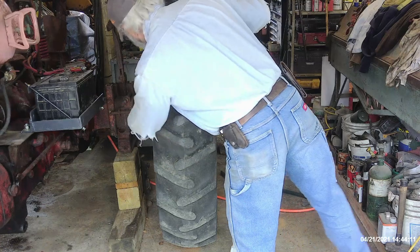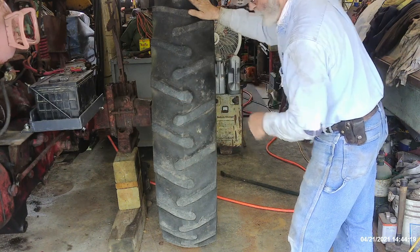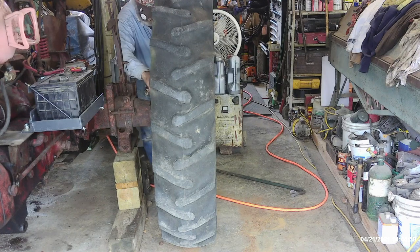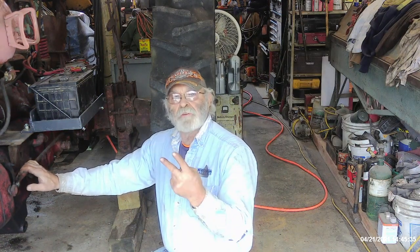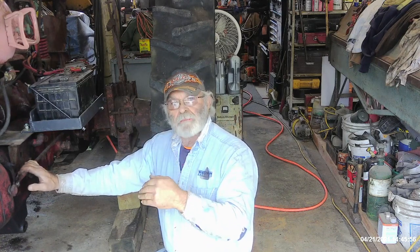I don't want that riding on the inner hub, so I'm going to pull it out just a little bit. I want to drive that locking piece of the hub in right there so I can hold it in position. Now I don't have to worry too much. I'm going to start a bolt in there, then pry this out just a little bit. With that in place, I'll take the other two bolts, buff them all up, get them coated with anti-seize, and put the other two bolts in. Then I'll take the two temporary bolts out, clean those up, cover them with anti-seize, and put all four in. I've got to shine up the axle — you already saw me do that on the inside, now I've got to do it on the outside. Shine up the axle, clean those bolts, put it all back together. Actually looking pretty good — let's do it.